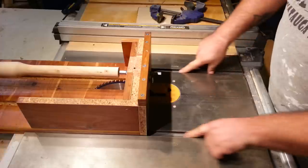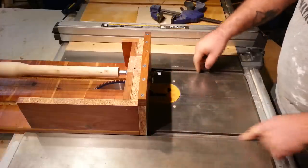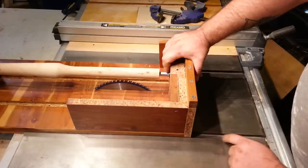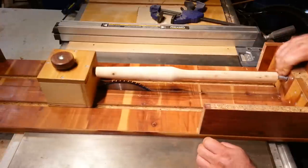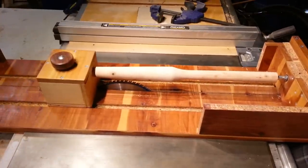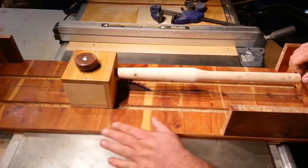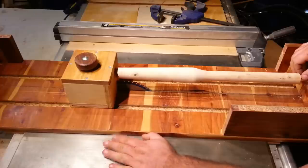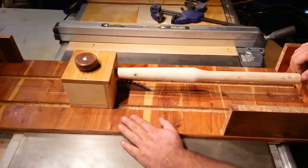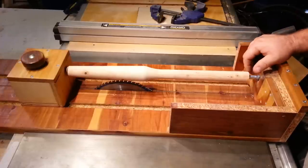My table saw is kind of old-school — I have T-tracks, and I know that's not available on a lot of models, especially the higher-quality saws that just have regular track. Because I have T-tracks I can run a dovetail slide underneath here, and there's no way this is coming out. I can literally pick up this jig by one side and it will move my whole table saw. If you don't have that and want to try something like this, you'll need some kind of clamping system to clamp a piece of wood down so this thing can't jump off and come back at you.